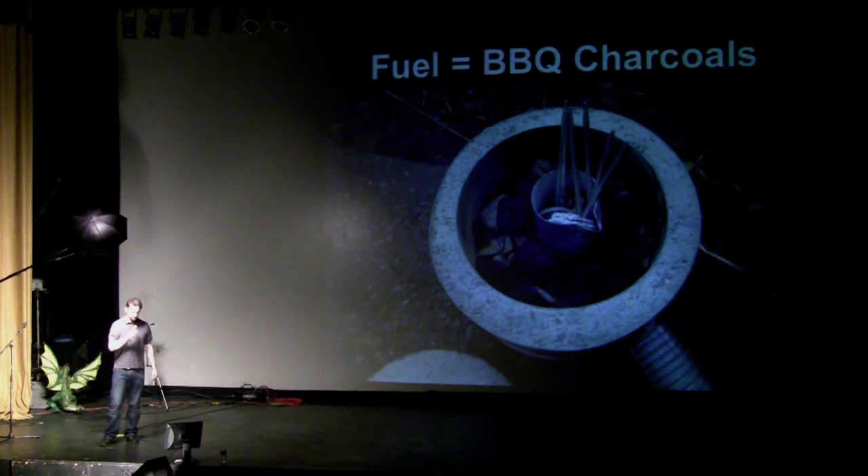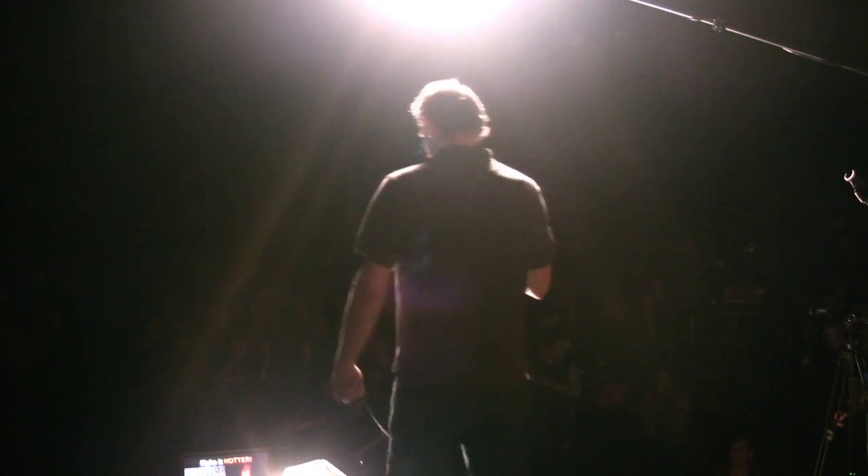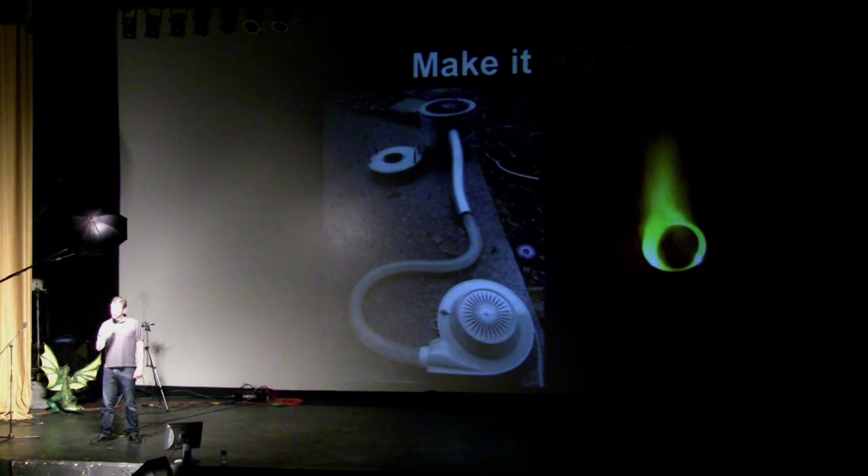Barbecue is the fuel. It smells great — your neighbors come over looking for steaks, boy are they surprised. What makes the difference between a furnace and a fire in a box is forced air. You get a thrift store hairdryer and you plug that sucker in there. By the time those barbecues have lit up, you're melting some metal. That sucker gets about 1,800 degrees and can melt brass, but we're sticking with aluminum.